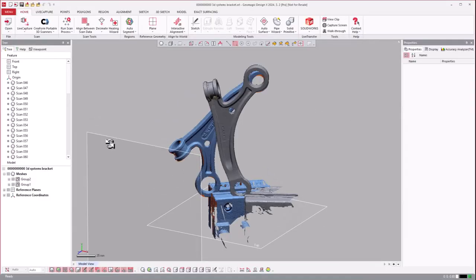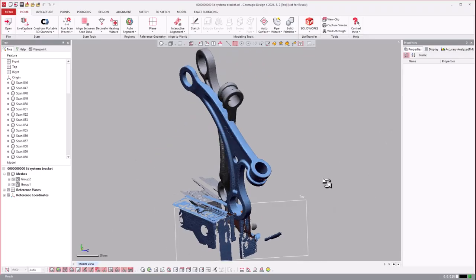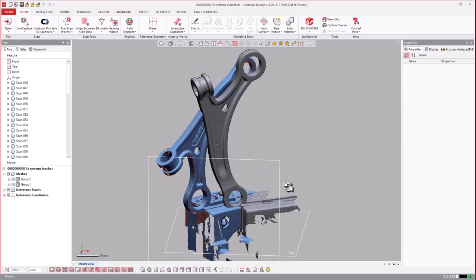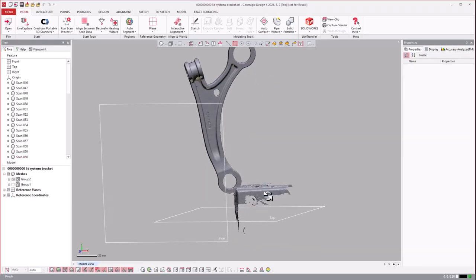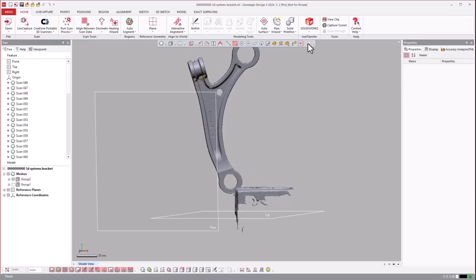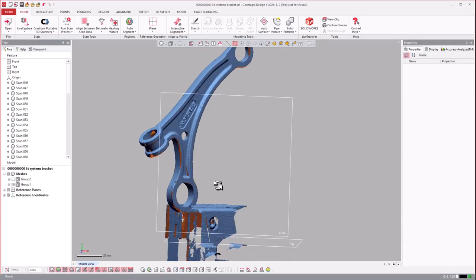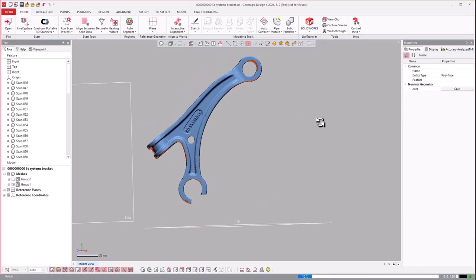In this tutorial we'll take scans that were collected — we scanned this object in a vice and flipped it over and scanned it again. We'll go through the process of taking scans, putting them together, making them watertight and printable, and creating a model you can send directly to additive. To start, we'll take both groups and crop out some of the data using the built-in selection tools, including a polygon selector.